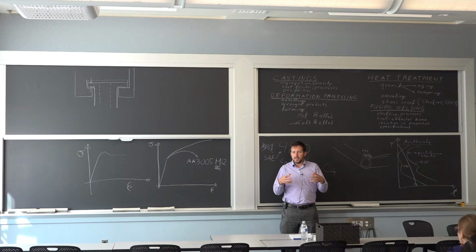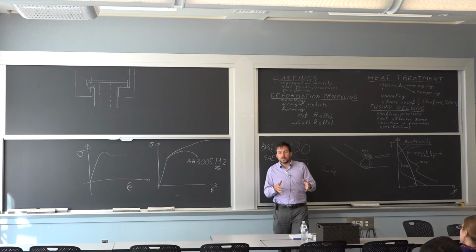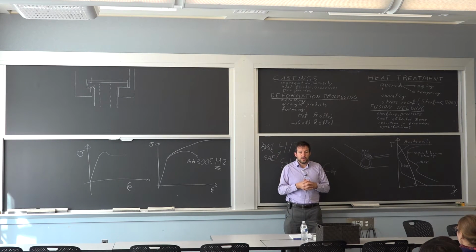So you essentially do a lot of times if you do the powder metallurgy, and to get rid of the porosity, you can either do a HIP process, so hot isostatic pressing, to remove the porosity. Now you have shrinkage when that happens, so there's a little bit of a limitation. Or you will forge it.